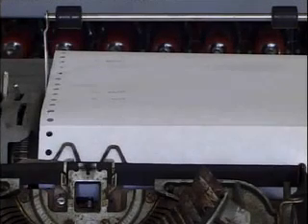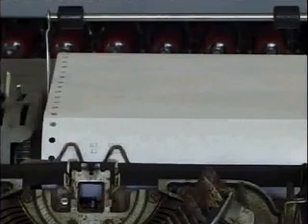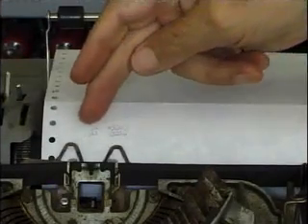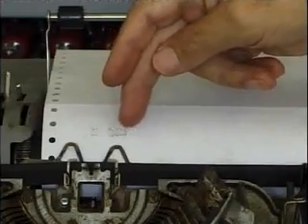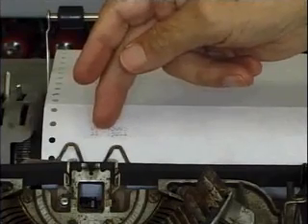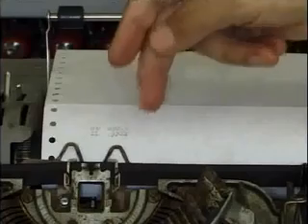By switching in the printer, we can go through the run starting at position one. That has now found two counts in excess of three thousand: one at O1 at three thousand and five, and the larger one at eleven at counter C, three thousand and eleven. That means the A counter is on eleven, the B counter — one back — is on ten, and the C counter is on nine. So it's found position nine at three thousand and eleven, which is what it found on a single-stepping run.